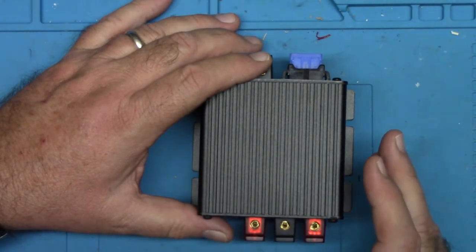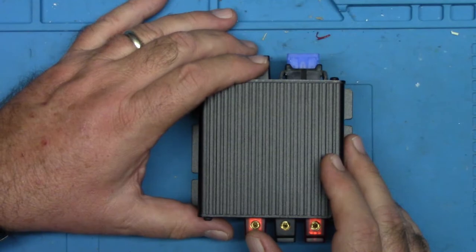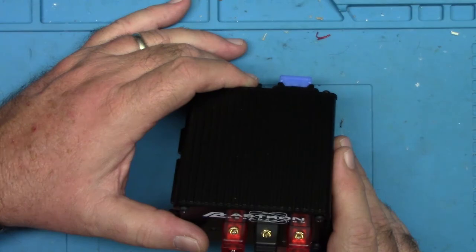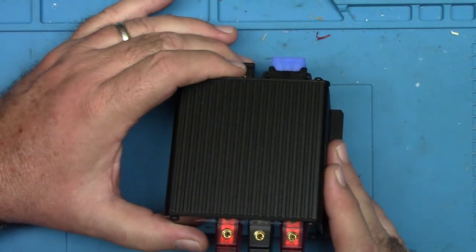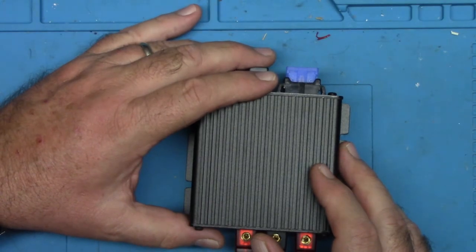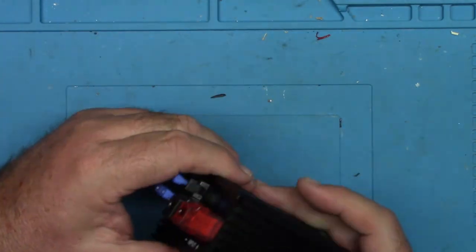The computer I use is a MinisForum micro-ATX machine, so it will run on its UPS for quite a while. Theoretically I could operate FT8 for four to six hours. On single sideband with a 20 amp-hour battery and this doing the switchover, I'd estimate easily six to eight hours of pretty much non-stop SSB — obviously at a much lower duty cycle than FT8.